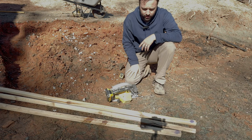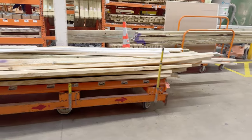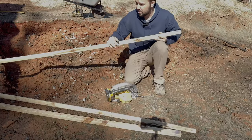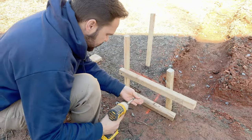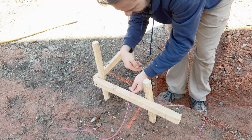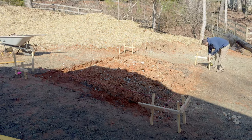Now we're going to put up some batter boards around, and that's going to help us guide where to place the lumber. A little trick: if you go to the big box stores, you'll find spray-painted lumber on the clearance section — usually 70% to 90% off. They're not the best lumber, but for batter boards or scrap boards, they'll do the job. To set up your batter boards and string, I use three stakes on each corner, then run one board on each side and use it to tie the string to. The batter boards and string at this point are just to make sure my pad is square, so I won't worry too much about leveling the string and will use a 4-foot level instead.